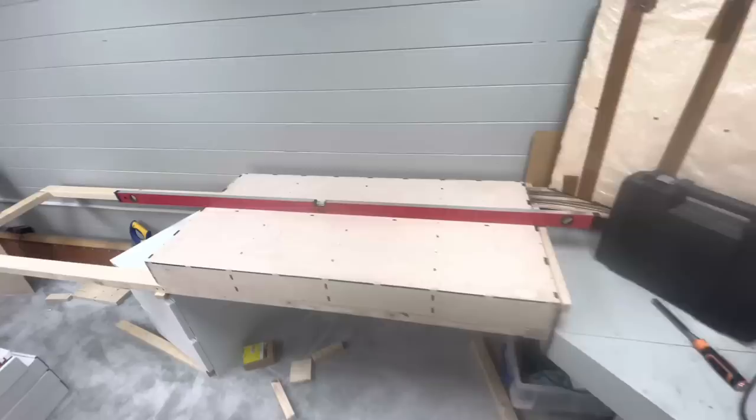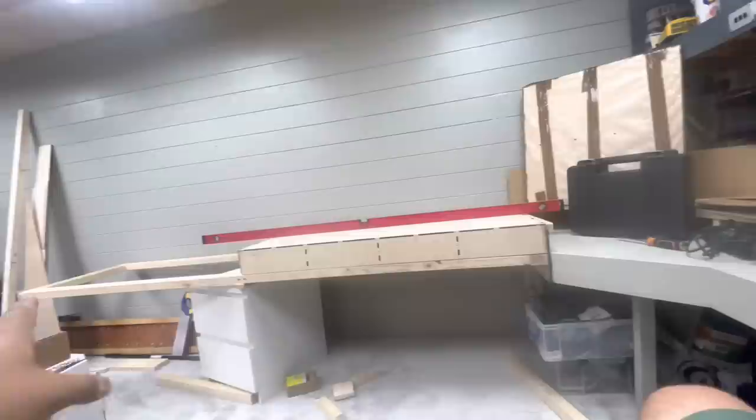So you can see what I'm doing here. I've got this plain 4x2 board with no back seam. It's a lot smaller to manhandle. So bolt that in position. Got the level on there. A couple of packing pieces. And now I know the height where I can screw the frame into the board this way. Then I can start making some legs over there and in the corner, in the middle, sorry. So yeah, it should work nicely.